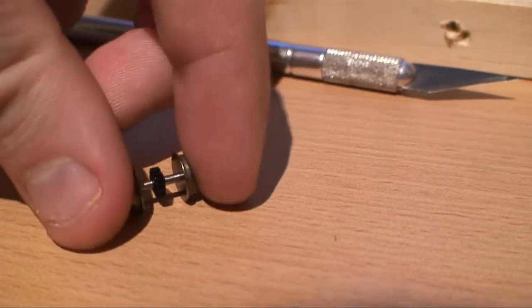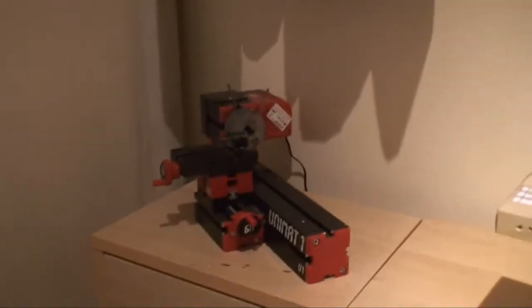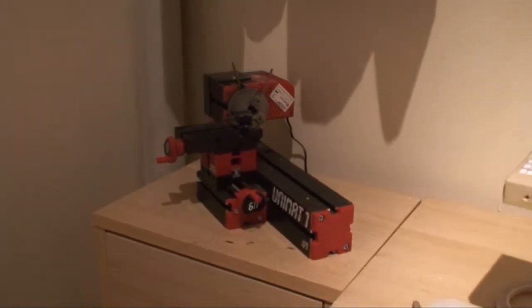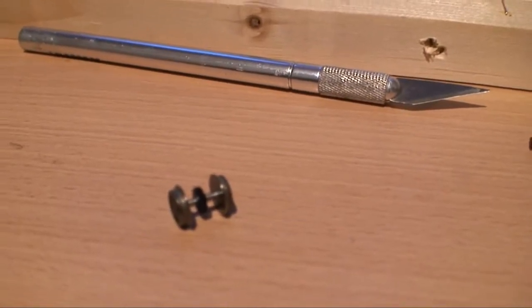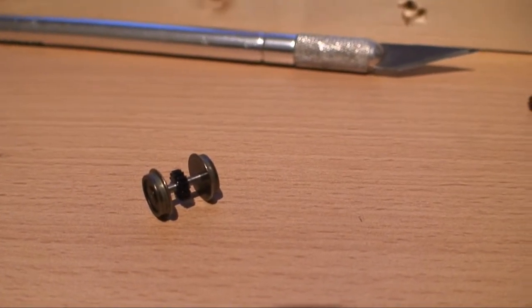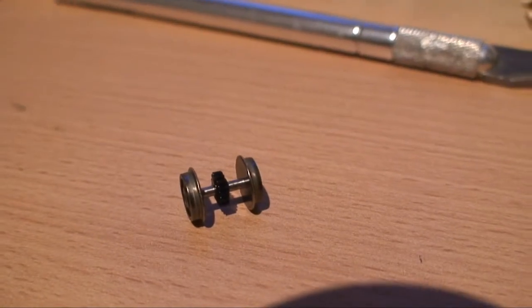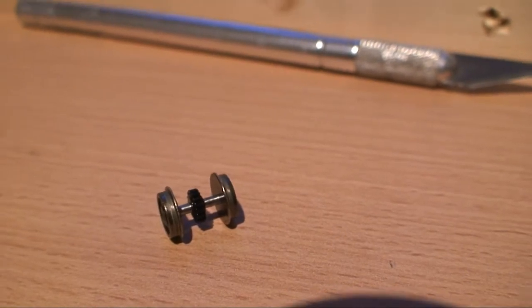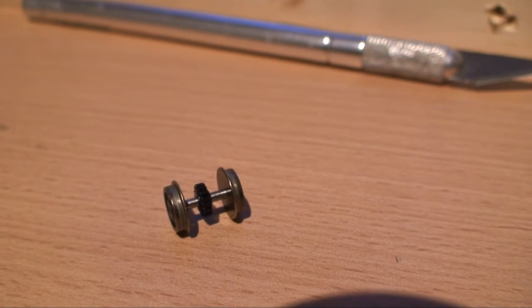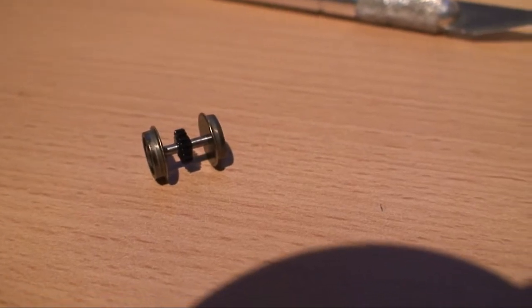What I'm going to do is actually remove each of the wheels off the axle using a pinion puller. And using a very cheap lathe — actually a Unimat 1 — mount the wheels on a plastic spindle, which I'll show you how to do, and turn the wheels down. I'll turn the flange down from one side so the thickness of the flange is reduced to 0.3mm, then remove the wheel, turn it around the other way, and actually face off the tread down to 1mm. Hopefully giving a proper 2mm profile for the wheel.